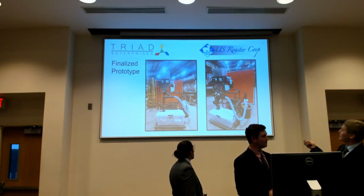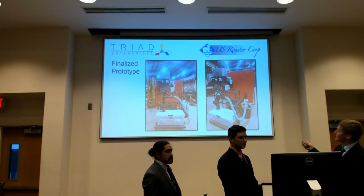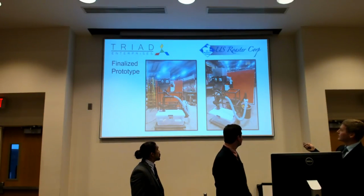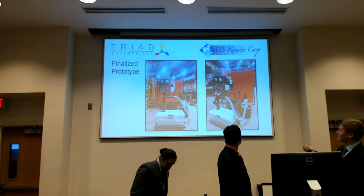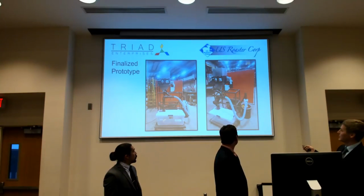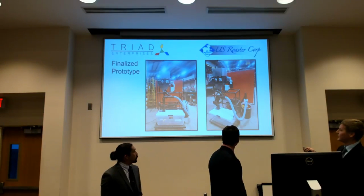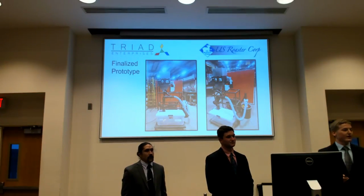So we put the beans in the hopper, and then our roller housing is in here. It rolls down through and gets crushed. Then we have a funnel that the crushed nibs and the hulls go through. We have a PVC tubing attached there. It drops here, and that's where the nibs go. And then the chaff goes up. We have a valve here and a valve down here. Those are discriminator valves, so we can open and shut them to control the airspeed.